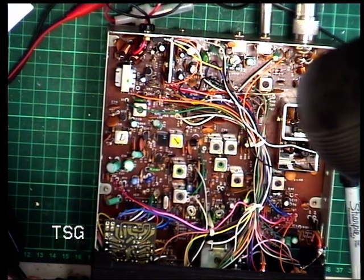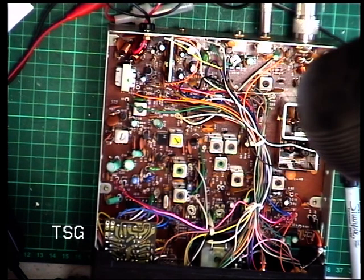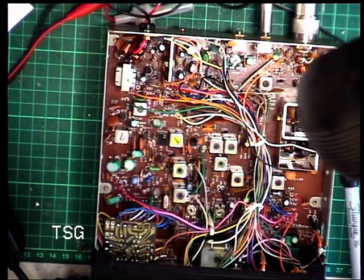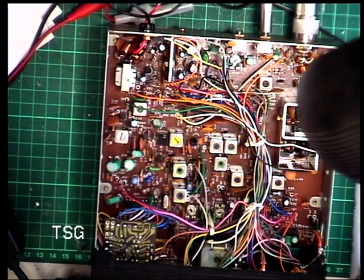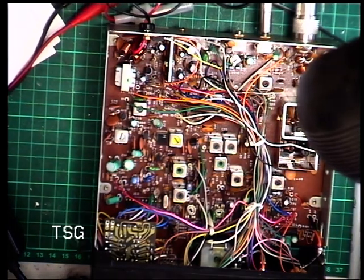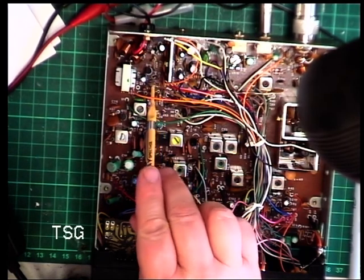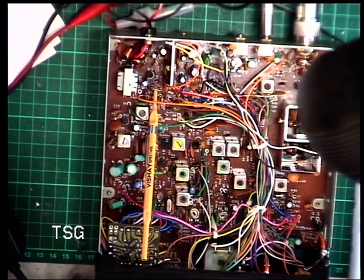So now it's going to be squelch. So switch the signal generator off, set the squelch to threshold. Switch the signal generator on, it's come straight in. Put the squelch to full. Turn the signal generator up. 1 microvolt, 3 microvolts, 10 microvolts, 30 microvolts, 100 microvolts, 300 microvolts. That's fine. So it's about plus 20 is the maximum. But just for the video, the adjustment is VR2. So looking at my crib sheet, VR2 is the preset just there. So I don't need to adjust it on this one, but that's what it is.